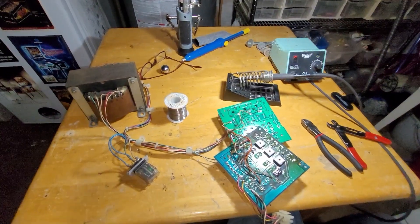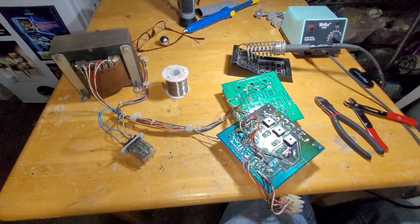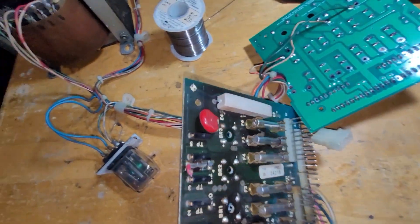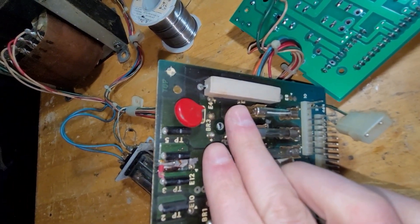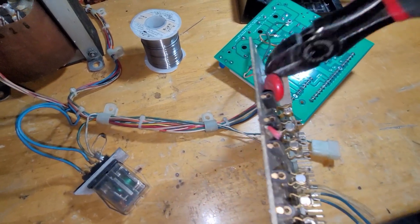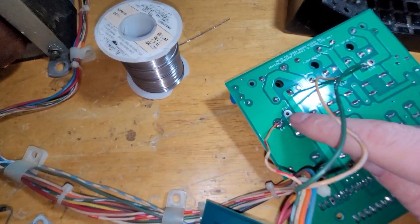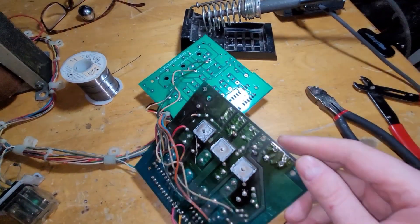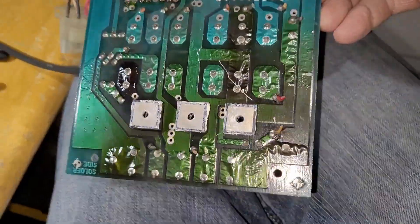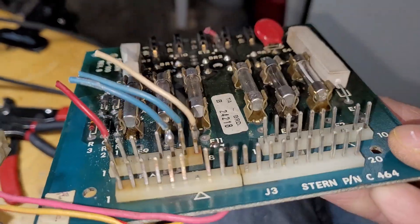Time to clear off the bench. I just bared my head down, got right into it, started snipping and clipping and soldering — I've got three wires done. I'll clip a red wire — it's labeled 'E-something.' I'll move that resistor, clip it right off. This board is no longer needed — so E1, red goes to E1, right there. Just one wire at a time, maybe 12 wires or something like that, and so far so smooth. There it is, the old power supply — no more.